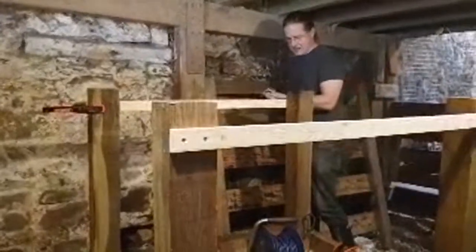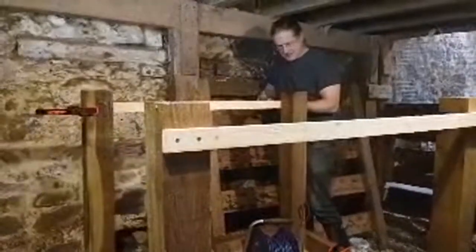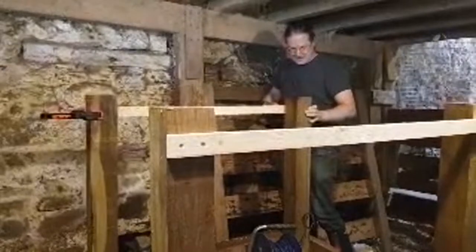When he's finished this, I shall show you the massive drill that he's using. And the biggest mistake that I see... Oh, Carol, you see the thickness of these walls. It's not really surprising they're still in use. This is one wall. Used to be an outside wall. Got a tape measure? No? No. Right, my hand is 6 inches. 6, 12, 18. That is about 23 inches thick, that wall. Modern render's gone there. So, yeah. About 22 inches thick, which is 2 foot-ish. Just under 2 foot thick. And the ones in the house are about 3 foot thick.